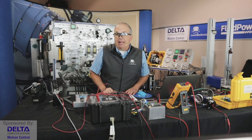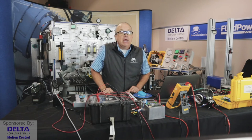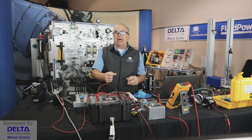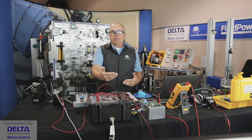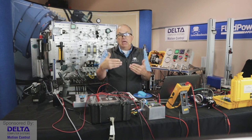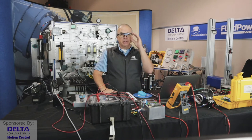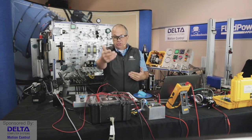But on many pieces of mobile equipment for construction and what have you, we switch over to something that might just be referred to as an ECM, electronic control module, which in many cases has all of the electronics in it that are similar to a PLC, but in a highly ruggedized case, usually very compact, and often the outside user has very limited ability to interact with the internal programming and make changes because the manufacturer may be very concerned about keeping private, for safety reasons, the programming they may have put in there for the brake system, steering, and what have you. But electronically speaking, there is indeed a lot of crossover and similarity between various electronic control modules and PLCs as they are applied to hydraulic systems.